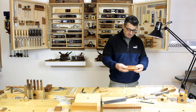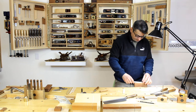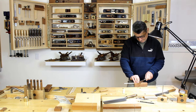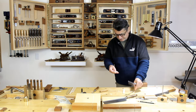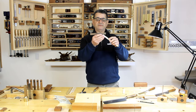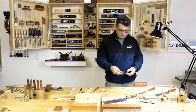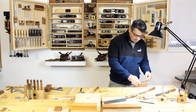These miniature small miter boxes are ideal for small components. I'd set it up in a face vise and use it to trim down to 45. It's as simple as that — that's 45. I'll check it against the protractor and against the inside head of the combination square against the fence. That's the preferred method of testing it. To create the slots you have to cut them at a perfect 45-degree angle — I'd recommend using a dedicated 45-degree square to mark it off and then cut, either using a fence or cutting fairly accurately on a pencil line.